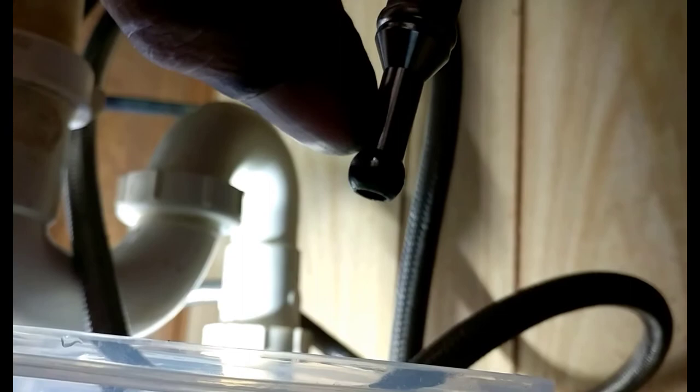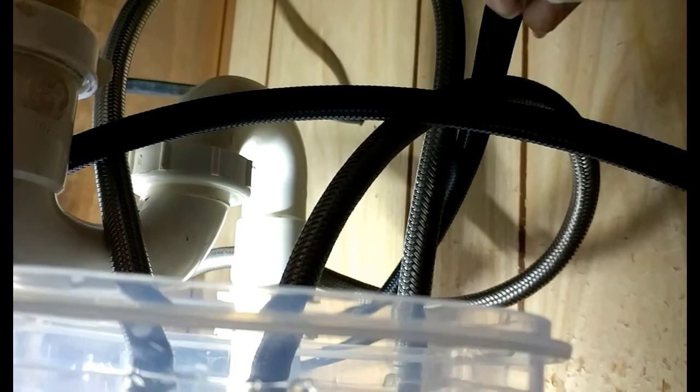You can also leave on your soap dish dispenser. You have to take off your sprayer hose attachment. Here is the part that goes up through the top half of the sink. There's a little plastic clip that fits onto that end. That actually goes onto the blue — it's your sprayer attachment. It has a weight on it down here. That goes onto the little blue connector. Your hot is the long one with the little piece of tape on it, and your cold is up there — that's how you can tell.